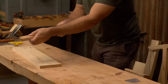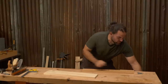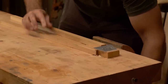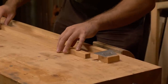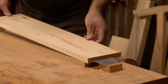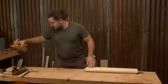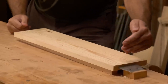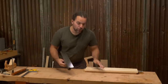The twist sticks are parallelish — about the same thickness. I put them down on the bench top. This is why I really like this style of spike, the paint scraper spike. I lift the board up so the sticks sit underneath. They can actually sit free because they're going to take no resistance. I take a board, plonk it on, just make sure it's overhanging the stick a bit — don't have to be precise. Wedge it in and knock it into the spike a bit — that's going to stop this end being able to shift.